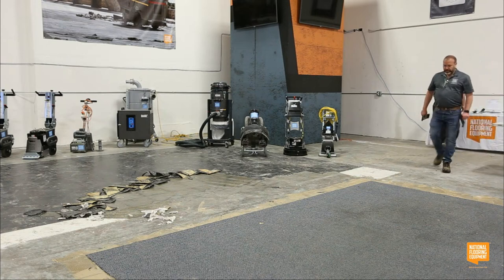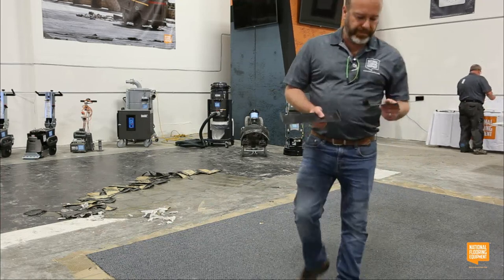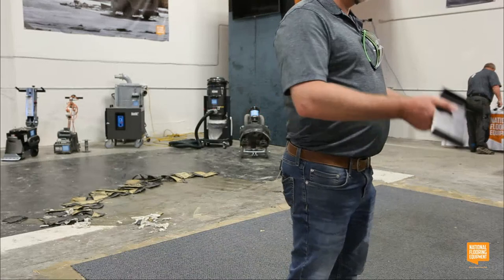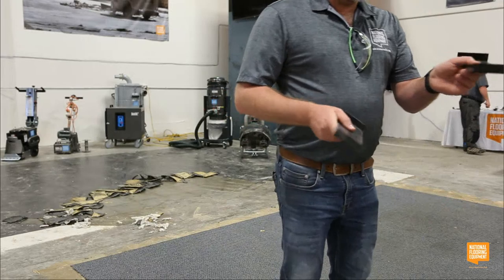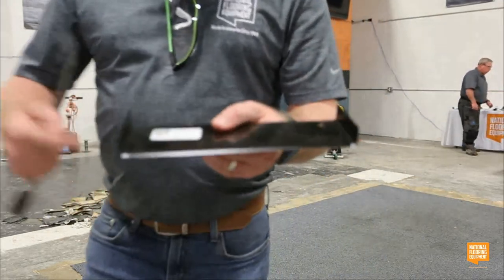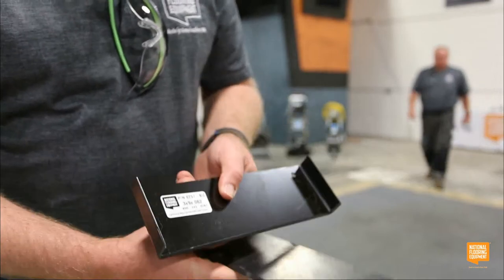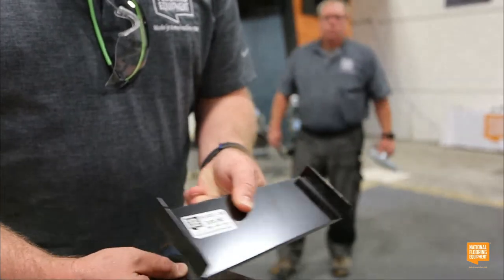Captain, you're the man. I can do that. Well, and especially for a home environment. So in homes, you typically see either slab on grade or you see a wood subfloor, and slab on grade, bevel up. So you guys can't see it here, I'll pass it around. The actual blade angle is on the top. So it's really gonna get onto that floor. Let's not cut myself there. And it's really gonna keep in contact and scrape things off of that cement floor underneath.